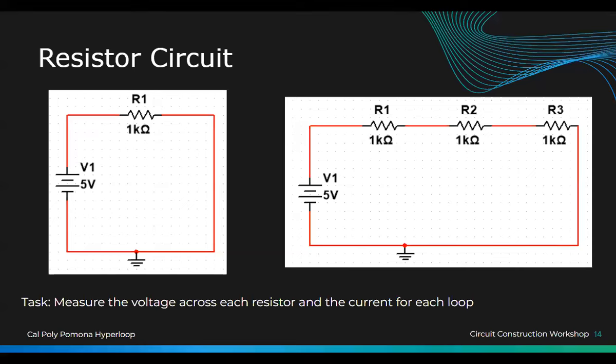So what I'm gonna do is basically disconnect the negative side of the resistor, and I will place the positive pin, like the positive red one, and here's the multimeter, and then the negative to this one, right? So that means that when the current goes, earlier we had it go directly like this, right? It's gonna go through the multimeter, do its magic, and then go back to the battery. So that's what the multimeter does. You have to get the current flow going into it and then leaving it, right?